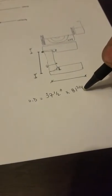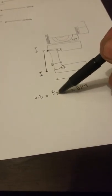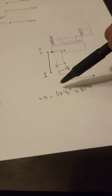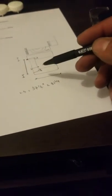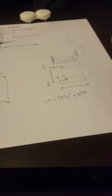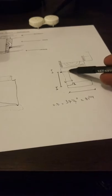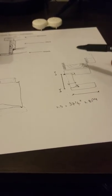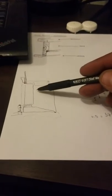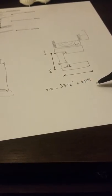Some vendors have different standard sizes, but across the board the unit size is always going to be around 37 and a half inches wide. Exterior doors generally come in 32, 34, and 36 — there are some 30s and 28s but those aren't common. So for a door slab of 36 by 80, the unit size is 37 and a half by 81 and three-quarters, following the logic of three-quarters to each side on the width, and adding three-quarters to the floor-to-head-jamb measurement on the height.